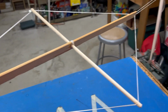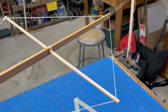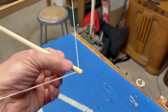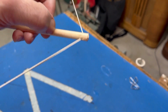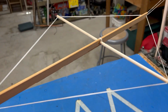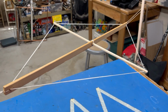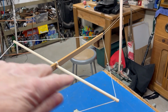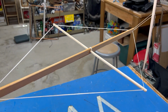So this piece was a pool strainer, an aluminum pipe with 5-foot pieces of PVC sticking out the end. So this distance on a 4-wavelength rhombic, from 88 to 150 megahertz, ended up being right around 27 feet across. And I forgot what this distance is, maybe 55 feet. I'll have to look. I have it all on the diagrams.